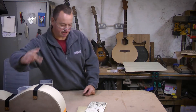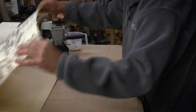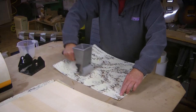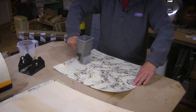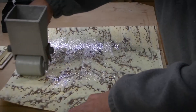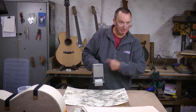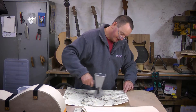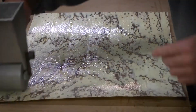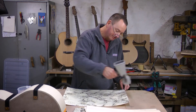So that's the side ready to go in the bag. Now I'll do the back as well - same idea. Fancy veneer on the outside, always applying the glue in the direction of the grain. Is there a reason to apply the glue in the direction of the grain? Because if you go the other way, you can see how it's really quite sticky - the veneer tends to wrap around the roller. And that causes swearing, in my experience. You can crack it in here too - especially on the cross-grain layers for the sides. They just end up in splinters wrapped around your glue spreader.